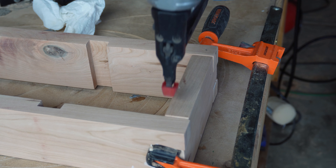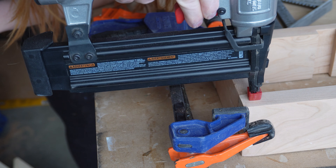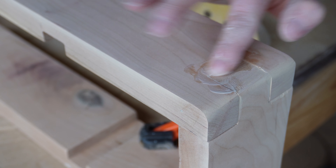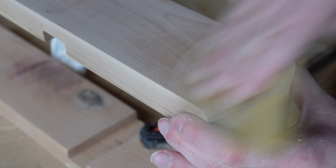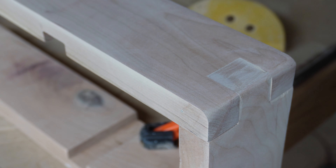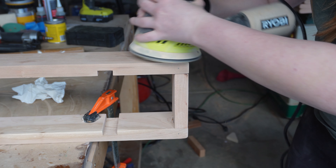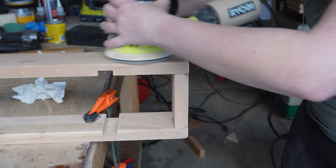Since it's a bit cold where I am I didn't want to rely just on wood glue to hold this together, so I also secured it using my brad nailer. I had a few gaps in my joints, so a little trick to fix that is to spread a little bit of wood glue over those gaps and go over it with some sandpaper — this fills the gaps with the glue and sawdust, making those gaps go away. Per the reference picture the frame had rounded edges, so I carefully rounded over the edges with my orbital sander, going back and forth until it had a nice round over, and then fine-tuned everything by hand sanding.